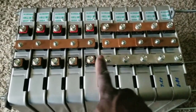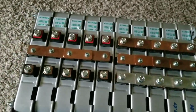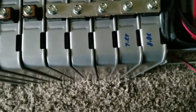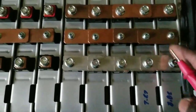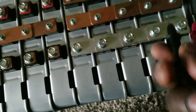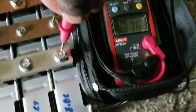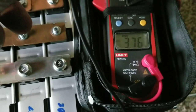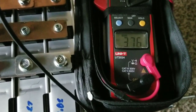I've got this system tied up and I'm still working on the bus bars — more needed here and here. I'm balancing this battery bank right now. I'm going to set up the meter to watch each cell, doing the center tap and all the positives on this side with the red leads.